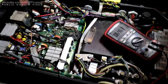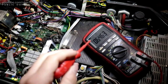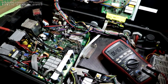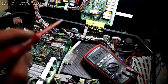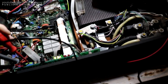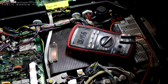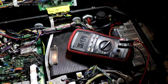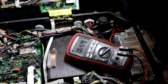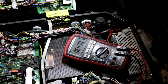So you can probably hear even better than I how this thing is screaming along, pushing out everything it's got. Notice how our voltage is 64.63 volts. That's going up because we're measuring right off the charger and it's pushing out current. The battery wants this voltage to be lower. So if we turn down the charge voltage, the voltage goes down and the charger stops screaming because it's no longer putting out all that it's got to give. That means we're able to adjust this charger down to even 64.3 volts, and I can turn it back up if I want to.